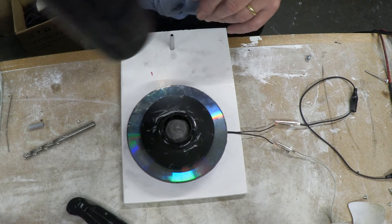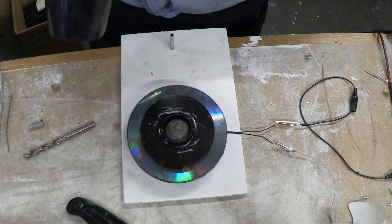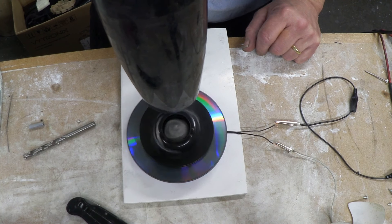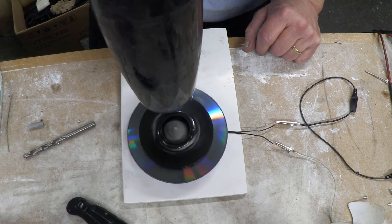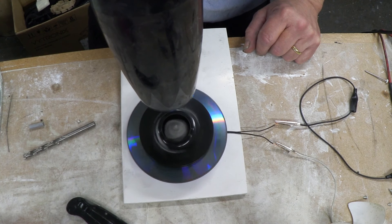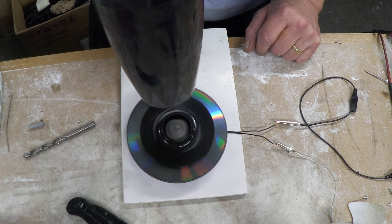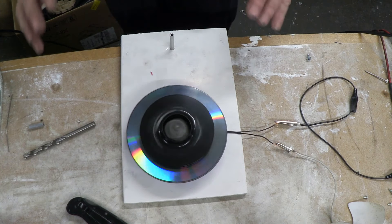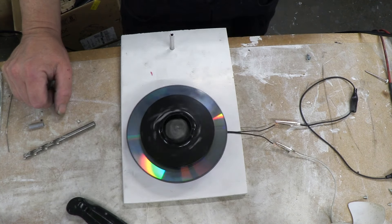With this one we had to hold the hairdryer quite close. So following Mike Waters' suggestion, I put a little cone in there — which is exactly what I've done now — and tried it again. That does an awful lot better: without the cone it's about five or six milliamps and you have to hold it much closer, but with the cone we actually get it to about 20 milliamps.